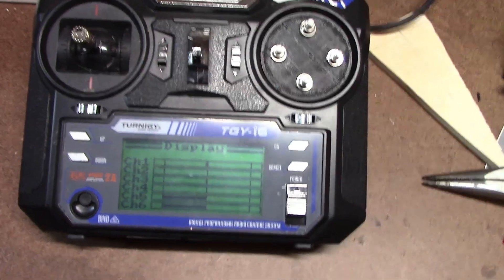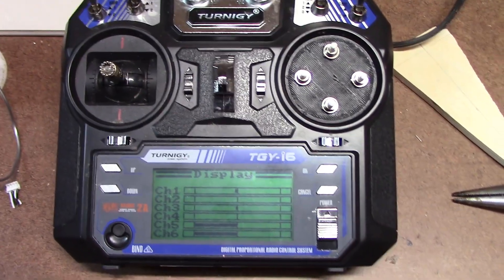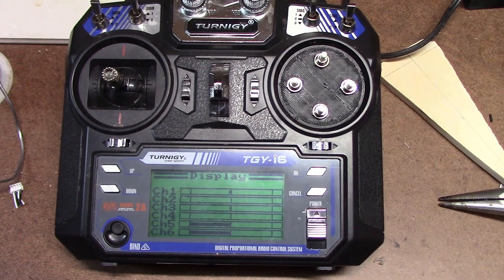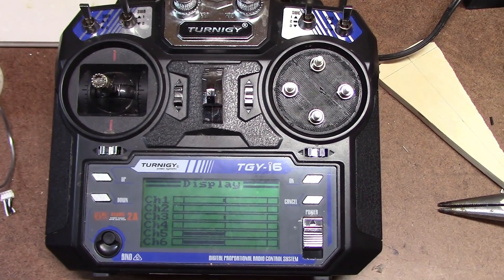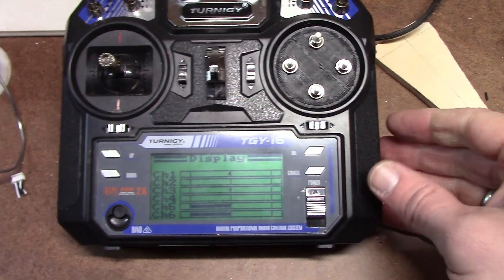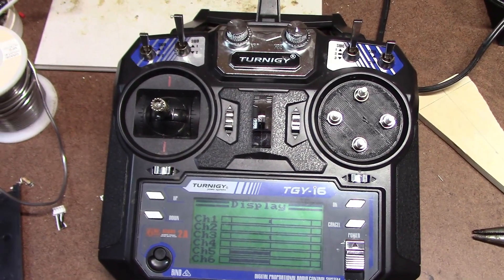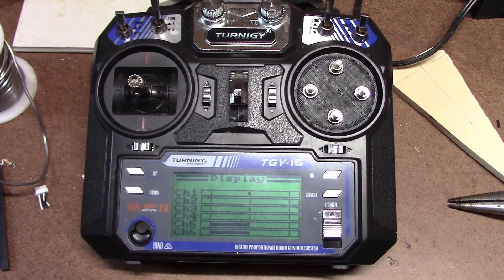As I press the button, channel 1 goes one way; pressing the opposite button sends channel 1 the other way. Same for channel 2 in both directions. It's working well. One key warning: don't push two opposing buttons at the same time, because you'll effectively short the radio out. These radios will just quickly reboot, but you risk damaging the radio, and in the middle of battle that's not a good thing. Now I'll just screw the radio back together and put little caps on. This button conversion is done — hope this video was helpful, thanks for watching.